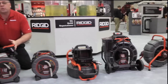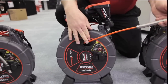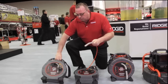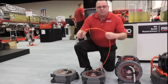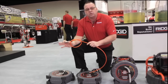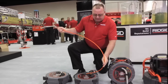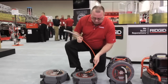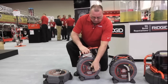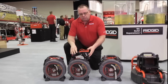We then move on to our micro drain. The micro drain's capabilities are from one to three inch. It offers a very highly flexible cable. One of the nice things about both the nano and the micro drain is the flexibility of the push cable itself. It has the capability of working most S-traps and some of your mop sinks and sink basins. Very flexible, up to 85 foot in length. What's also nice about the micro series is that it gives you several options on how you can use a monitor system.